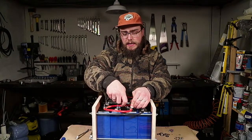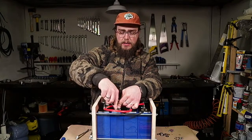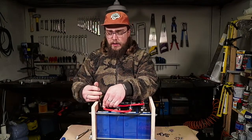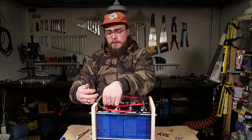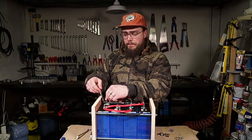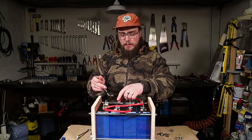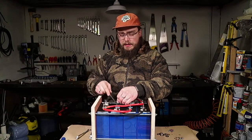In this instance, I'm not tightening them that tight because I'm not carrying big current through these cables. When I go to charge it now, I'm only charging at about 10 amps, so it's really not high current at all, and I'm not that worried about resistance. When I actually install this in a van with a 200 amp BMS and a 2 kilowatt inverter, in that instance you'd be more concerned about resistance and getting them as tight as you can — though obviously you can't tighten them too much or they'll strip. This is the terminal I fixed earlier with the helicoil.